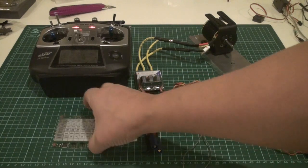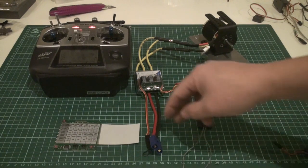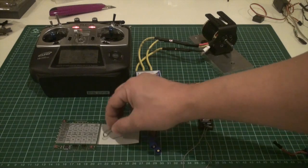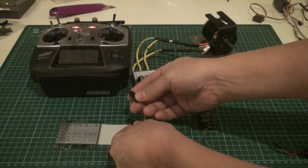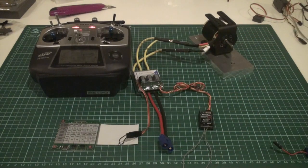You will need the prog card. The programming cable of the YGE looks like this on its end — there is a small loopback cable, and it is to prevent interference. When you're done with programming, put that back on. It's only on the high voltage versions; you won't need it on the low voltage version. There is no interference on that — it's when the volts go up that the interference goes up as well.